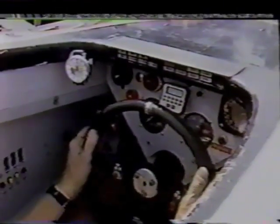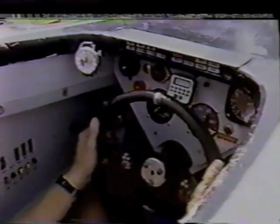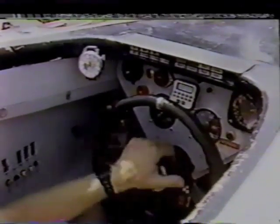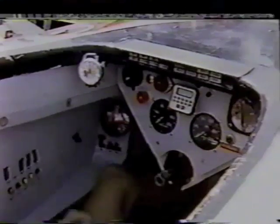This is obviously the dashboard. One of the safety features they've built into it is that should the boat be upside down underwater and this area has collapsed a little bit, they want to get me out of the boat. The steering wheel is designed to come off very easily — I simply put my hand in the back of the hub, pull a mechanism that moves up and down, and that clears this opening to get me out.